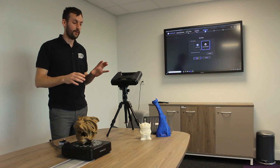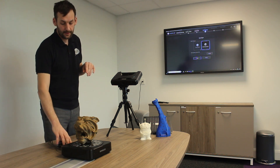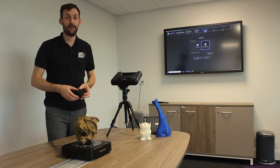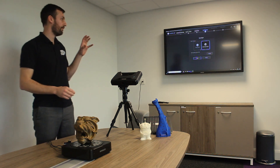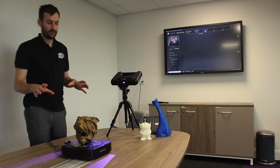We're going to do a fixed scan today. We've got the option with the 2x range of doing either textured or non-textured scans through the top mounted USB-C socket. For doing textured scans you need to add on the colour pack option, but today we're just going to do a non-textured. So I've got the software selected, we've picked a fixed scan and I'm going to select non-texture. Apply, and we're setting up our machine.